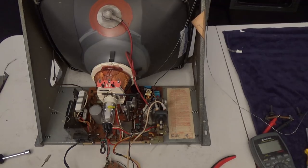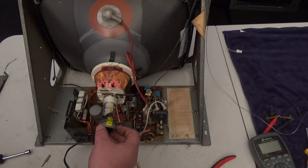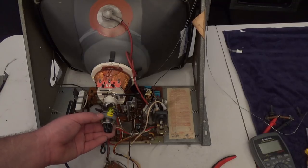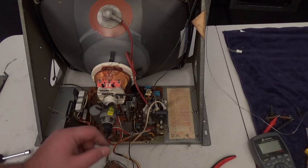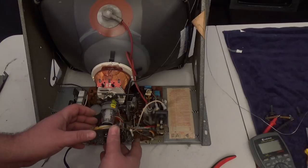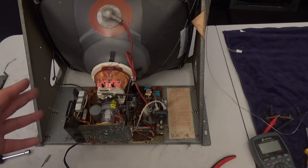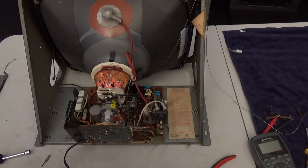Here are my purity rings. I can see some paint right here and I'll try to line that up, but odds are I'll have to move it around. The cool thing is these haven't been moved yet, so I may be able to just rotate the entire assembly until I get the correct convergence on screen. Let's hook this up and plug it into the machine. Depending on whether your machine has built-in test patterns, you may need a test pattern generator.